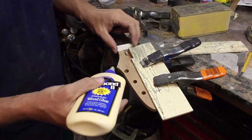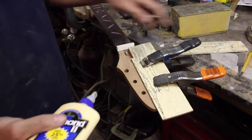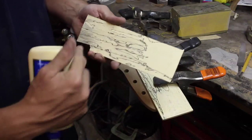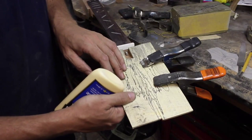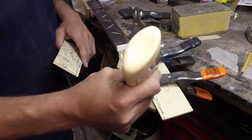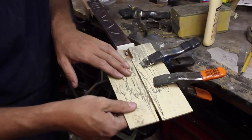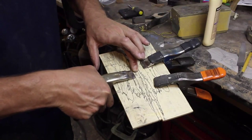I have the veneers both ready and I've got the nut just kind of sitting in here. I did plane these down quite a bit so that my bookmatch would be better, because the grain really snakes around pretty quickly on the sides. I figured the more I could take off the back to get it closer to tolerance, the better my bookmatch would be. I've already taken a pretty wide kerf out of the middle with the table saw. So I'm going to glue these up — I'll spread the glue out with a little paint stick and give it a good clamp.